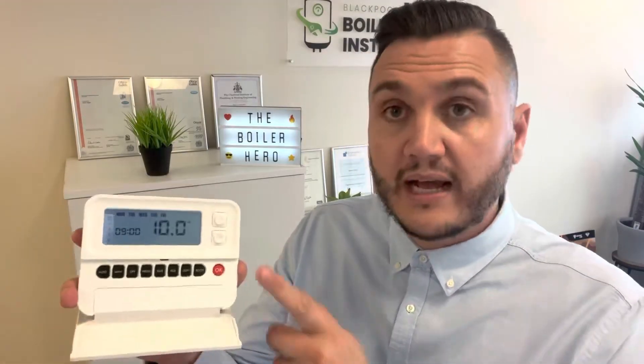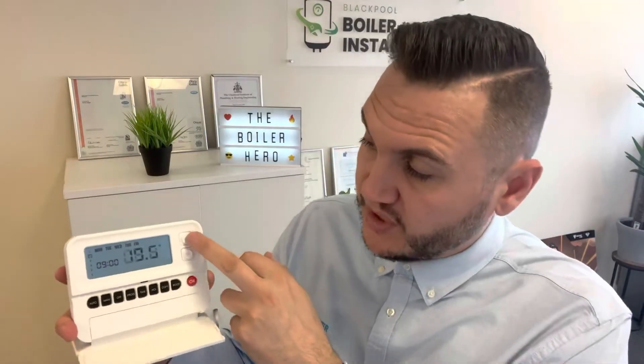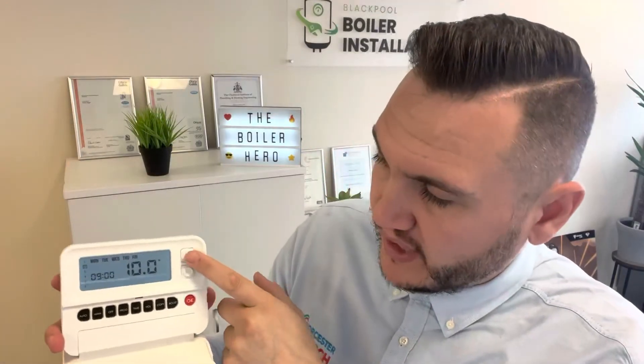The next one flashes — what time do we want it to go off? It's come on at 8, you might go to work at 9, so you just want it on for an hour. At 9 o'clock you want it to go off — press okay. Now the temperature is flashing again. This is the off temperature: while it's gone off, do you want it completely off? In which case you could have that down to say 10 and your house will never come on. Or you can set a setback temperature of say 18, meaning if the house drops to 18 in its off period it will come on as a precaution. Most people who do it this way keep it really low because they want off to mean off. So for this example we'll go down to 10 for its off time, and press okay.